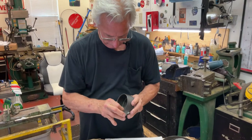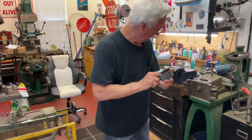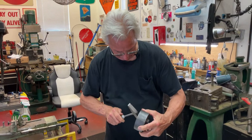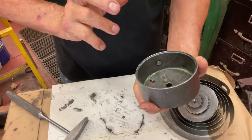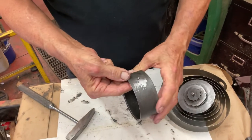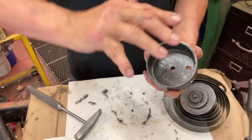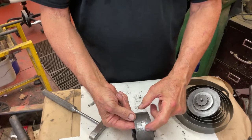So we'll take this. We tapped it in — you see here how I've tapped this in. Now on Edisons, because we want to make this look like it's an original Edison, I'm going to turn this over and I'm going to run a piece of flat steel here. Because this nipple that holds the end of the spring is flat. We don't want to bend it like this. And then I will take a ball-peen hammer and I will peen this over.